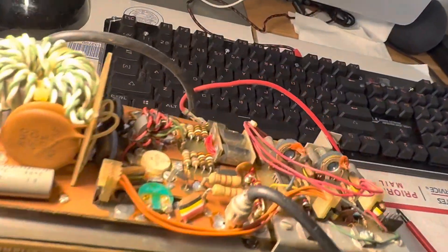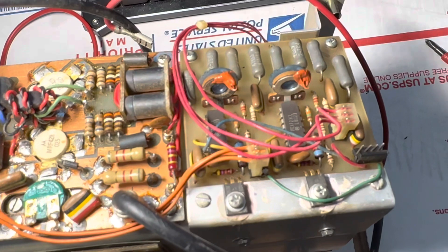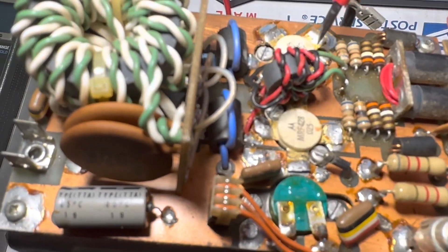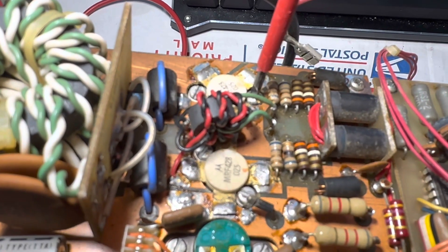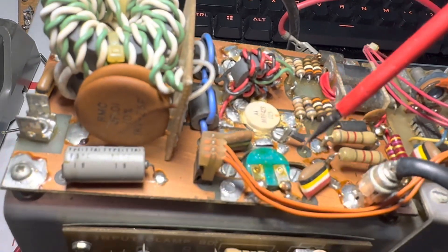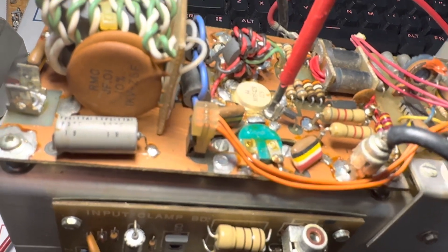I could pull the other board and renew the silicone paste. I may end up doing that. I'm going to try and see if these are tight. You shouldn't over-tighten these or tighten them unequally. That one's good and tight. That's good and tight. The other one was really loose - I think that's why that transistor on the other side went bad. It wasn't tightened down very well, which makes me think somebody was fiddling with it.